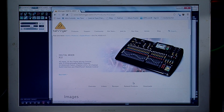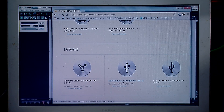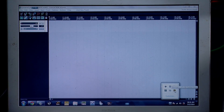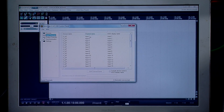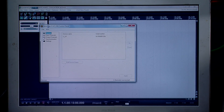We'll go down and click Downloads, then scroll all the way down until we see the USB driver — that's currently version 6.13.0. You want to download this, install it, and it will ask you to disconnect and reconnect your X32. That driver sits down in the control panel, and we can open it to see that we're connected to the XUF with the serial number. We see our input devices, output channels, and some synchronization options. Pretty much the default installation settings will work fine.